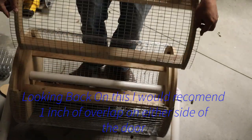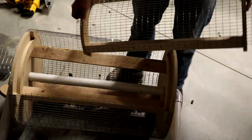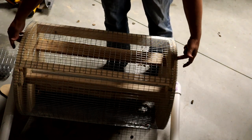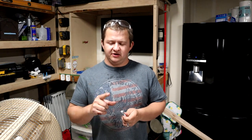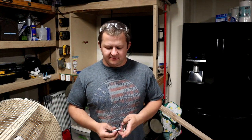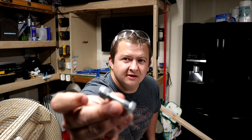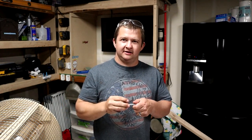Check it out — voila! There's our door, just a piece of screen on the top. We have our catches, put it in place, drop it down. Now all we have to do is drill some holes straight through the side and we're going to put a little pin assembly in there that holds it all together. I was going to put a cane bolt — kind of like a little L that pushed through and then swung out of the way — but I couldn't really find materials in my garage to do that simply. For most of you doing DIY projects, you probably have a bucket of bolts laying around.